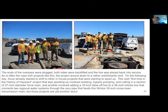Jeff G said, sorry, I missed what this skid slide material was. It's a hot rolled A572 grade 50. I mean, it's A36/572 grade 50. So just run-of-the-mill structural steel. That's great. And the skids were, I believe, like half inch thick. But there was no material that came off of them, not in pulling at 300 feet. That's amazing. That stuff is going to last and last.